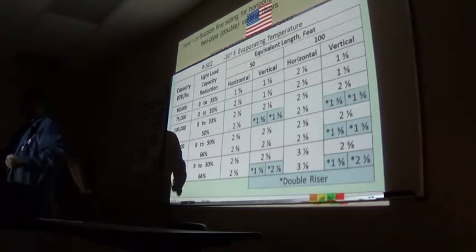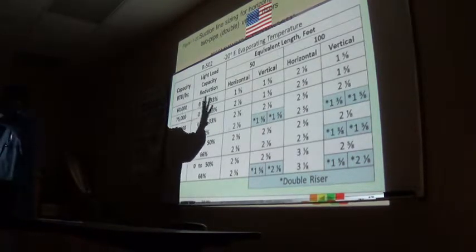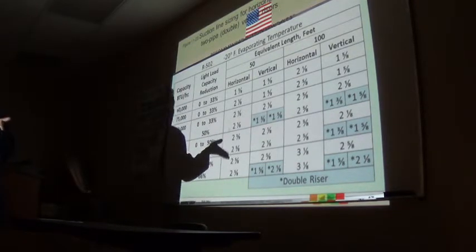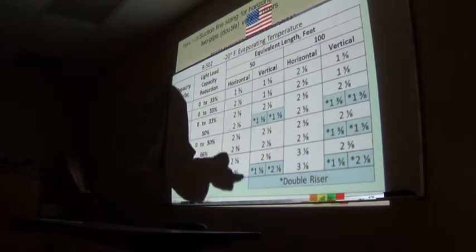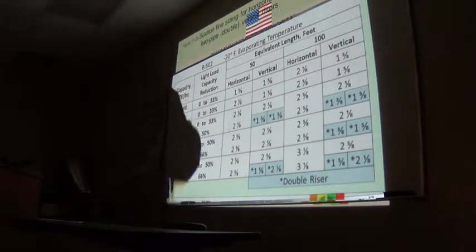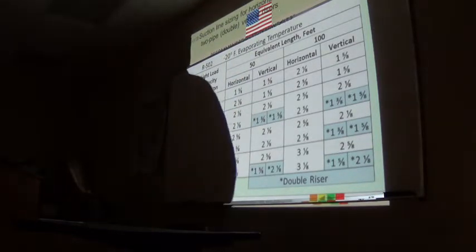And you go in there and they have all the shelves around, all the shelves look nice and shiny. But they have empty pots and pans in there, but no food. So there's no load on the box. You tell them, guys, it is gonna be like this until you buy the product and put it in this box. It wasn't designed to run empty. I mean, if you wanted something to cool pots and pans, just put it outside and hang it somewhere. You don't have the product that's supposed to be supplying the load.